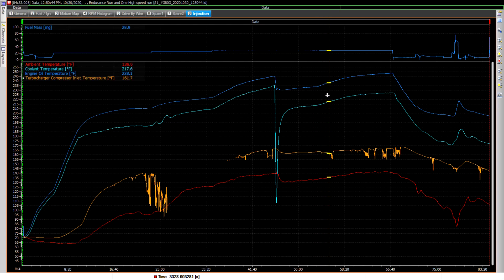With the heater running it's like having an additional radiator. I ended up running it up to 28.9 milligrams of fuel and it stabilized at 248 on the oil temp and 227 on the coolant — I'm happy with that. The red line at the bottom is the temperature of the air blowing out the bottom of the radiator, and the orange line is a makeshift sensor on the hot coolant going from the engine back to the radiator, though that one probably isn't reading very accurately.